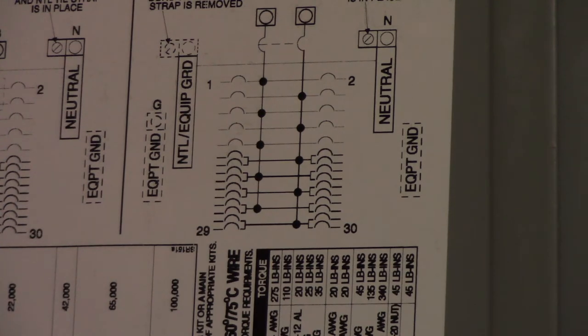So that's why I need to set those breakers up the way I described. Obviously I'm not going to get into this breaker with the power on, which means I won't have any lights since it's too dark outside to open the garage door and see what I'm doing. I'll have to put this part off until another day when I can get at it earlier and have light in the garage while I turn the power off. It's a new day and I'm continuing. I've got the panel off and I've already verified with my multimeter that there's no power in this box by checking all the lines coming in from the main power breaker.